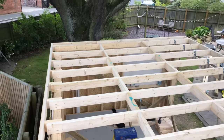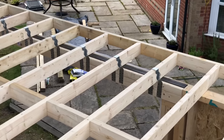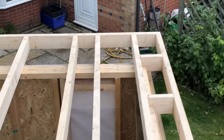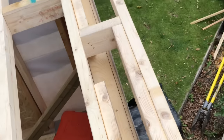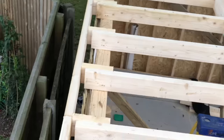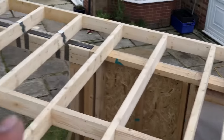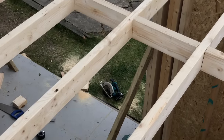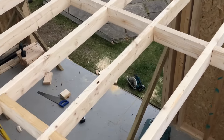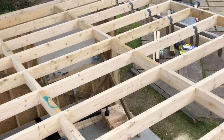The full roof is finished. We've used 5x2 timber, joist hangers to strap it down over the steel, and spiked it to the wall plate to stop the wind lifting it. I've shown the front trimmer, side trimmers, infill pieces for plasterboard support, back trimmer, and two rows of noggins all the way down the middle. We used a circular saw as the chop saw was on another job. It just needs breathable membrane, rubber, soffits and fascias — which I'll show in the next video.